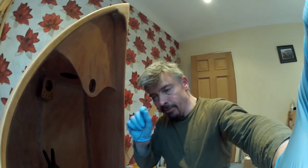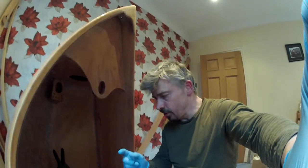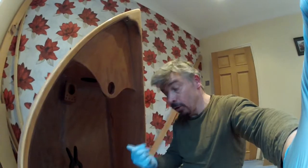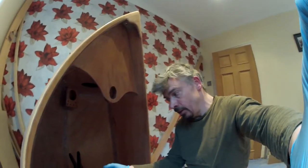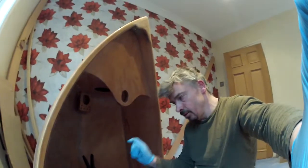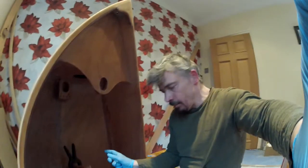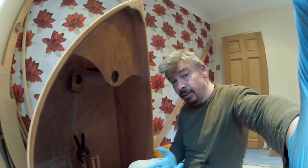I did drill out a little bit of an indentation so that the screw head, or the very tip of the screw as it goes through, will go into that indentation, and that indentation will be full of epoxy because it'll fill up while I'm gluing these together. So I smeared glue into the hole, into that indentation, and when I clamp that on, the pressure will squeeze the glue into that indentation even further, and so that should be fine.